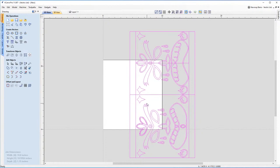And you may be thinking, well, why are you rotating the design now? Well, the reason is because we're actually going to be wrapping it this way. So when this comes to toolpath, it's going to be wrapping it this way. So while we do design it vertically, we need to make sure we flip it at the end, because we're going along X, but we're wrapping around Y, and Y is this way. So we need to make sure the design is also facing this way. And we also need to make sure that our design fits onto our sheet.